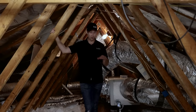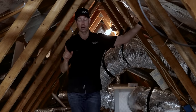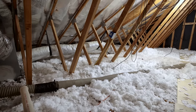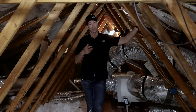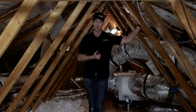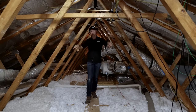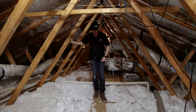First, the issue with this attic isn't just that it's low on insulation — the bigger issue is that we've got a pretty leaky connection between the attic and the house below. We did a pre-blower door test and this house scored 9 ACH50, which is a measure of how leaky the house is. A big part of that leakiness is coming from this attic. New construction in Texas requires 5 ACH50; northern climates require 3. This house is about three times leakier than it should be.